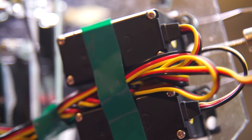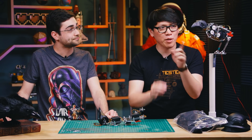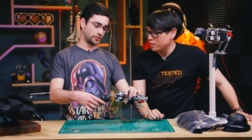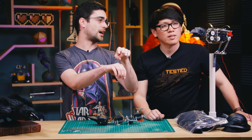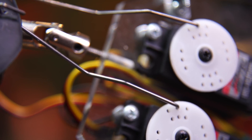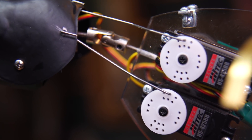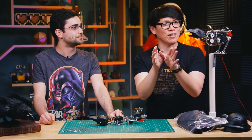The mouth is open when the body is in this position — exactly, when the wings are up here. One of the coolest parts is the head movement because that's two servos. How are you getting two axes of movement even though the servos are on the same plane? It's really simple — there's a little universal joint right here which lets the head move freely. The top servo's wire connects to the very top of the head, and the bottom servo connects to the side of the head. It's just pushing it in the right spot so those two coordinate and land anywhere. The angle the wire is bent and where the contact hole is — that's all fine-tuned to get that nice head tilt movement.